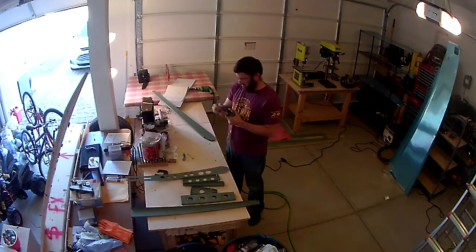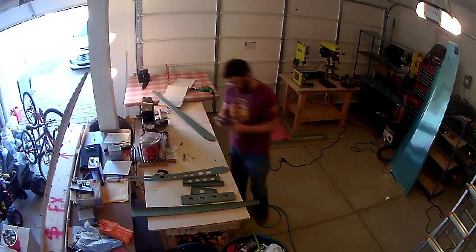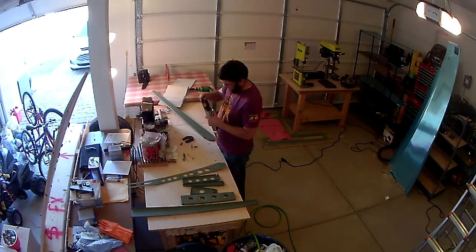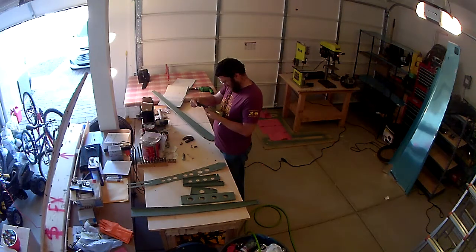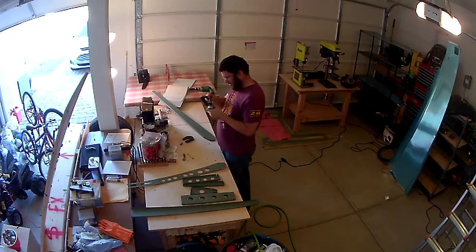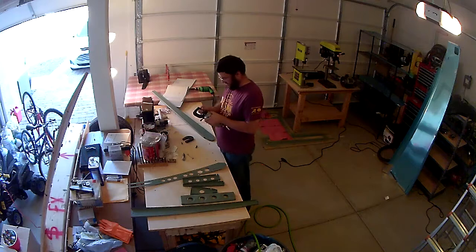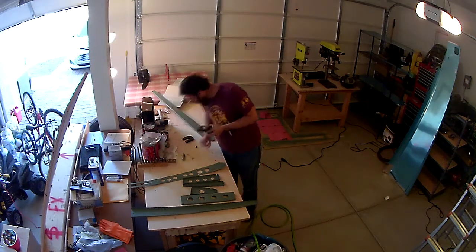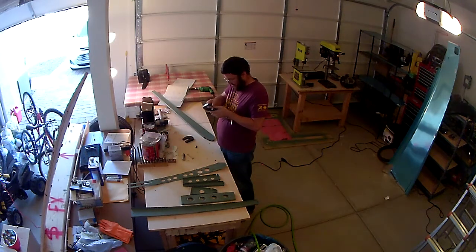And I think here is where I've gotten rid of the adjustable ram for the pneumatic squeezer and have gone to just the standard ram, which requires using spacers on each of the bits. And it works a lot better now that I've gone to this ram instead of the adjustable. As I said before, I accidentally bent the adjustable ram by overextending the ram and then squeezing with it, so it became useless.